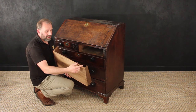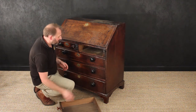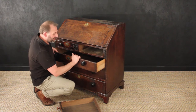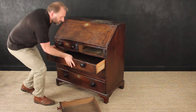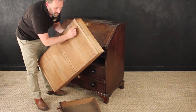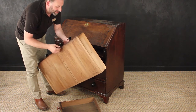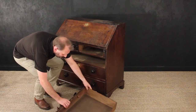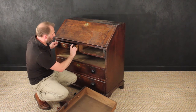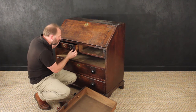The drawer is missing its entire side, so we're going to have to cut a new piece of oak for it, along with the back, with hand-cut dovetails. The drawer guides need to be replaced, and also the drawer runners — there's too much movement. The runners taper towards the back, which is where the most wear is from moving back and forth. This lip here is very susceptible to being damaged, and a lot of it is missing on the front face of this drawer.